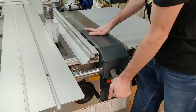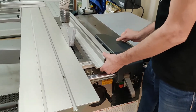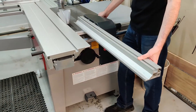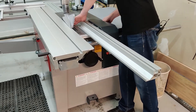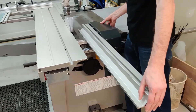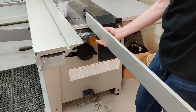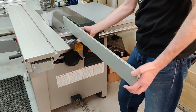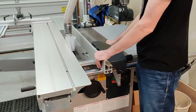This locks the fence into place — it is very sturdy. You can adjust the fence and bring it out like this, so when you're doing a rip cut your fence doesn't drop the wood next to the blade. This is typically the way you would use the rip fence. You can also lift it low if you're doing angle cuts or a thin piece, or do a high fence, which is more what you would see on a North American table saw.